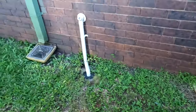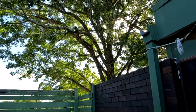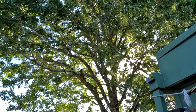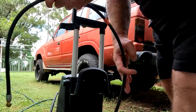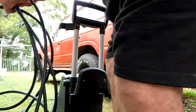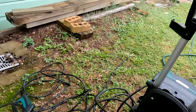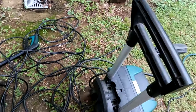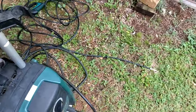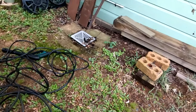The biggest problem with tree roots is if you happen to have a big massive tree nearby, because the roots can spread for a long, long way. This is a particular problem when you have old earthenware pipes — maybe broken or meeting new PVC pipes — because when it's dry especially, the roots seek out water. It's marvellous how tiny roots can make their way through, and once they're tiny roots they grow into big roots, and therein lies your problem.